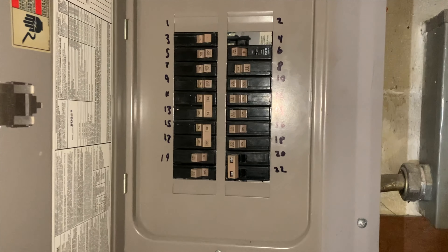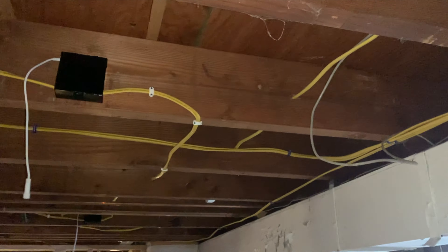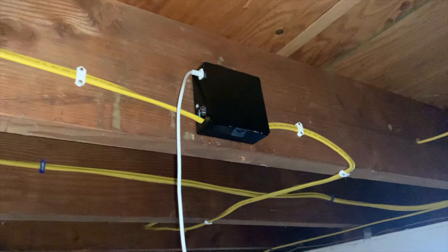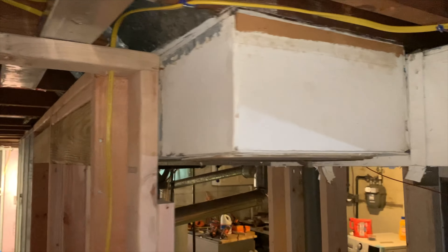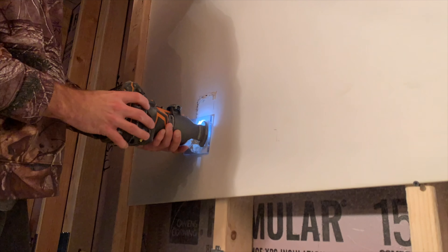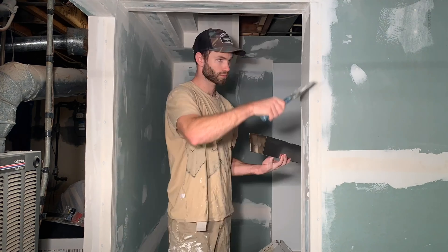For the bathroom electrical, we started at the panel board and ran all new cables along the joist. Because we're using a drop ceiling we can run them along the joist; otherwise you'd want to run them through the joist. The first circuit goes into a switch controlling recessed lighting and feeds the receptacles in that area. The second circuit is a 20-amp GFCI-protected dedicated circuit for the bathroom — most codes require this. That circuit powers a GFCI outlet, the LED mirror, recessed lighting, and the exhaust fan. After this point, it was time to install the drywall; a routing tool is the best way to cut around electrical boxes.